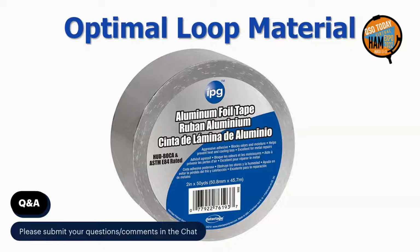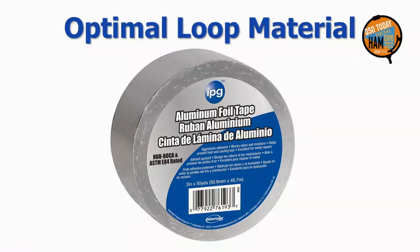Self-adhesive aluminum foil tape on PVC pipe is the optimum magnetic loop conductor material. It is readily available in widths from 1/4 inch to several inches and in thicknesses from 1.5 to several mils on the internet. Local hardware stores also carry it for use on air conditioning ducts.